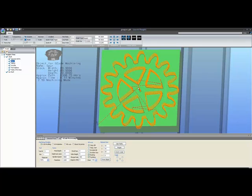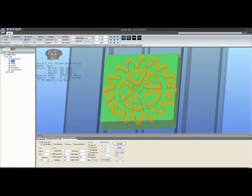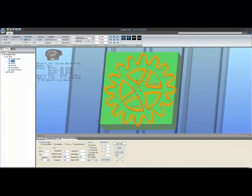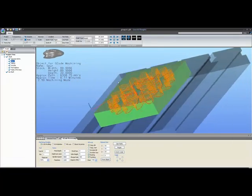This means if you were to put a gear on here with spokes which were meant for a laser cutter and therefore have some very highly intricate spoking, you could still machine it. You just would not get contours cutting out the complex bits. So that's considered a feature, that it's automatically discarding anything that it cannot do. You can see that it is intelligent enough to know that shaft holes should be drilled first, spokes should come out second, and finally the outside shape of the involutes will be cut.